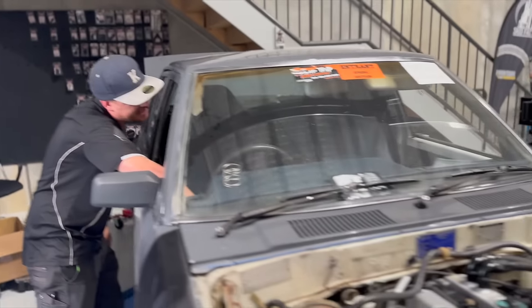With the four port solenoid we're able to run from five pounds through to 24. To put it in perspective, even at 24 pounds of boost we're only at about 24% duty cycle on the boost control solenoid. Kai just wants to see the magic 600 horsepower number - and so do I, truth be told.